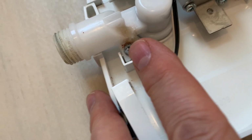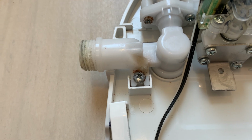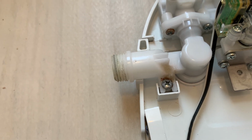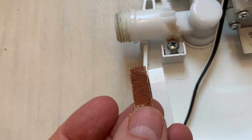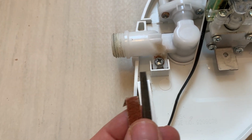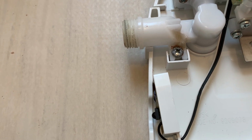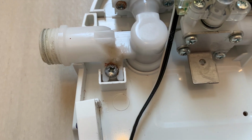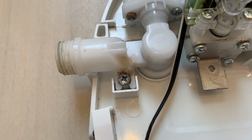And then to make sure that your epoxy sits okay, grabs okay, it's really important to rough up the surface. So after you put the super glue on there and it's dried, take some really rough sandpaper, like I use a 60 grit, something really rough, and I just folded it over basically a small implement like this, and then use that to rough up the surface of where I was going to apply my epoxy, because you want that epoxy to grab. And sometimes just a file is a little bit too smooth. You want something that makes pretty good scratch marks.